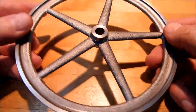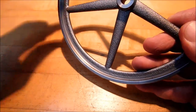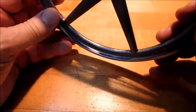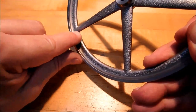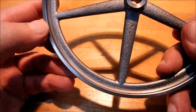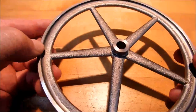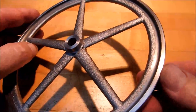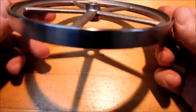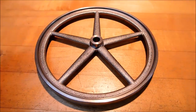375 hole through the center. All the burrs are taken off. You will still encounter some degree of inconsistency in the wall here, depending on how aggressive you are deburring it. And even the radius itself that's on here when you're done is going to affect the way it looks like it's running. But this is a highly visible part. I can guarantee that it's going to be running within a thousandth or two every which possible way you could imagine when it's done. I do not have the 5-degree hole in it yet, but that is just redundant.